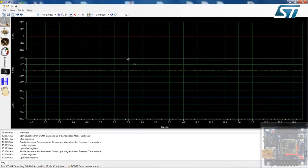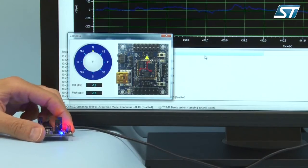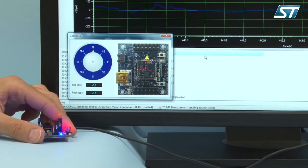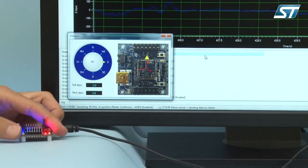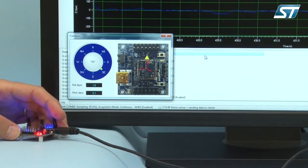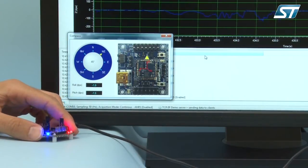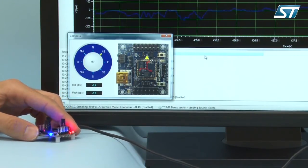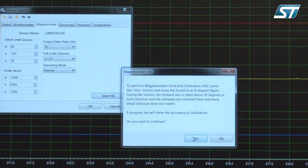The Tilted Compass is an additional demo included. To enable it, check the Compass box in the Sensor Settings window and then click on the Compass icon. Tilted Compass is used to compute the heading angle when the board is inclined, making use of the accelerometer and magnetometer outputs. An automatic procedure for magnetometer calibration has been included to improve heading measurements. To enable it, go to the Magnetometer Sensor Settings window, start calibration, and explore all directions with the board.